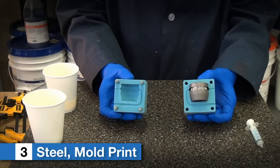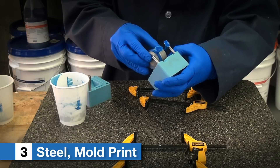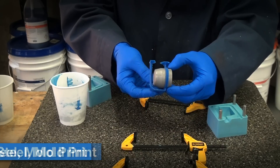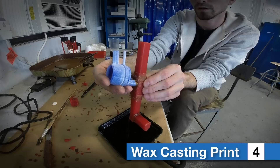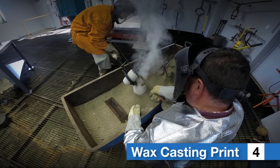However, this time a mold was quickly created from a selective laser sintering print and a urethane ring overmolded onto the steel body. The fourth approach was to wax print the projectile body and use the lost wax process to quickly make a zinc projectile body.